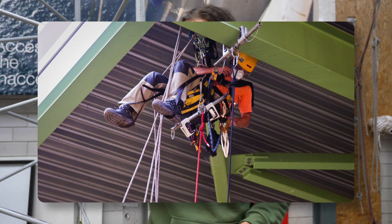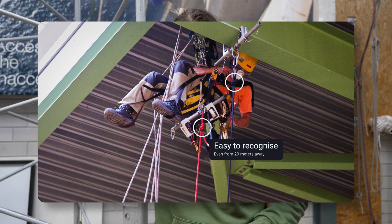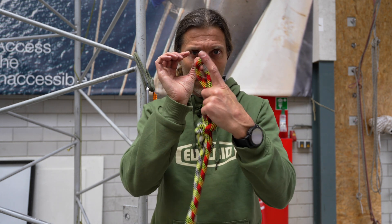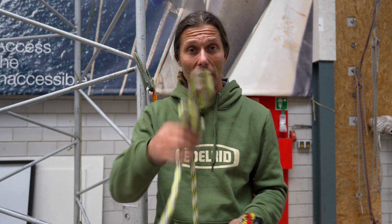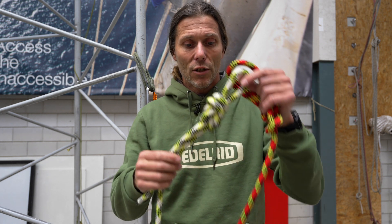One comment I get from recreational climbers is 'why don't you just go over there to inspect the knots?' Imagine I need to work underneath a heli deck and there's a 15-meter climb involved where I need to drop down. My level two technician goes over, ties his figure of eight knots, rigs them, and I can inspect them from 15 to 20 meters away — I even have a monocular for that. If I would have to climb over there to inspect, I put myself in a dangerous situation where I might not be able to be rescued. I keep my rope access technicians in situations where I know I can rescue them — so if I need to climb over there and rig it myself, who is going to rescue me? Being able to inspect from a distance is very valuable.